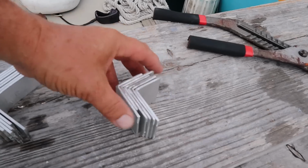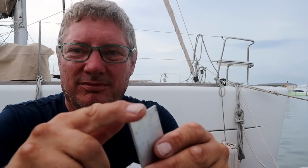These other ones are made out of actual aluminum angle. And those will go on the top side of the curve of the bimini where the solar panel is almost touching the roof, so they don't need to be as tall, and I was able to just use angle for those. I want to get rid of some sharp edges and some rough corners in case, you know, line gets caught on it or your hands or fingers.